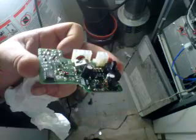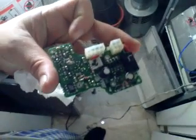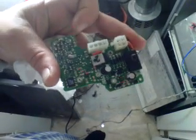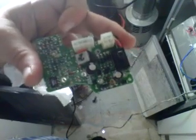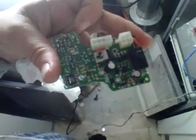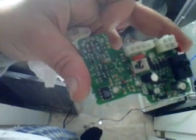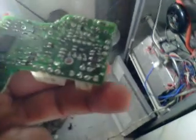You're probably asking yourself, now that I've got it off, what do I solder? Your typical failure points are going to be the larger pins or pin connectors, through-hole. Typically surface mount devices, once they're on, they don't typically fail. What does fail is the bigger connections.